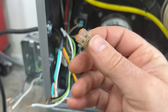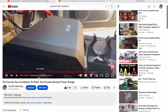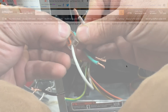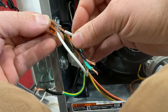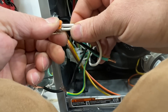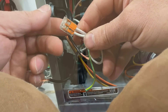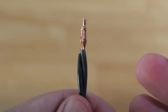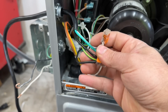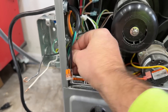They've done a lot of testing with these and they're a really great product. If you're curious where to find them, you can find them in our Amazon store — go down to the video description, click my favorite HVAC tools, and you'll see an electrical category. You simply open up the lever, slide your wire in until you see it touching on the back side, lock it in place, and it's good to go. The beauty of these is that you don't have to worry about a stranded wire getting wrapped around a solid — if you're joining a solid and a stranded, this is a way better connection than a wire nut. All our connections are made: black to black, white to white, and green to green. We'll tuck these back and put our panel back on.